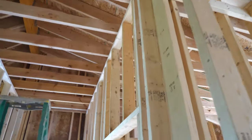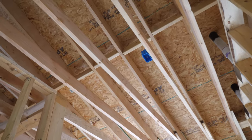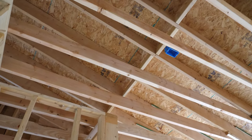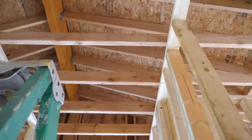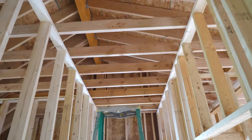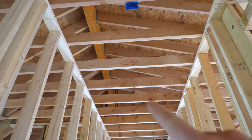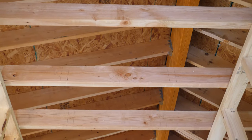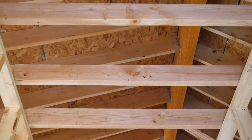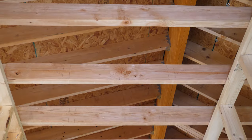I originally was planning to put the attic hatch in the bedroom, close to where that smoke alarm box is, but I learned the code requirement of needing 30 inches of headroom above the ceiling joist, which I just don't quite have there. So it'll make more sense to put it in the hallway — I'm going to get a flush-mount access door from Bestaccessdoors.com to make it as low profile as possible. It's going to be 22 by 30 inches, and I basically just have to cut out one little piece of a joist and frame in two headers, so it's actually going to be really easy to frame.